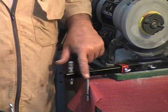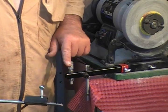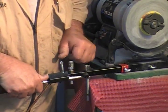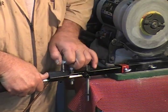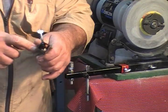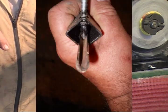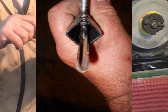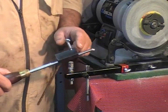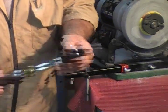I told you about the 2 inches. If you can see this little black bar sticking out here, that is 2 inches back from this edge, and that's the third number in the Ellsworth math: 2 out, 4 down, 7 out. I'm going to push this out, let it touch that bar, and then tighten it down. I know touching steel to steel, you're worried about getting dull, but you're going to sharpen it, right? It's important that this sits square. I sharpened the end of the thumb screw to match the bottom of this gouge because I want it to square up really nice. I am ready — 2 inches out, snug, and square across. This is ready to go.